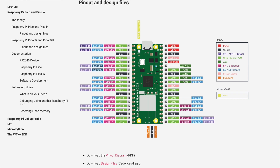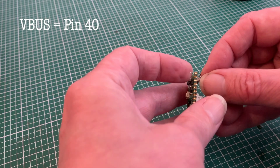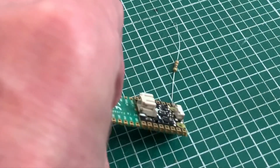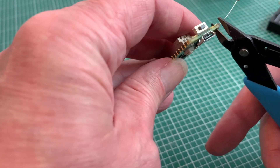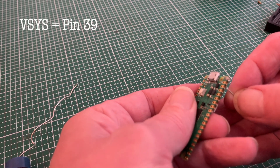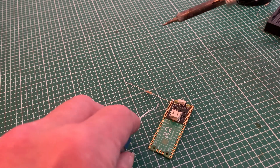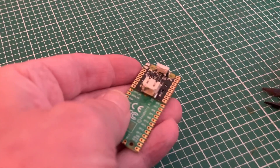First I want to double-check with the pinout diagram which ones are which. A good place to start is pin 40 in the top right-hand corner for VBUS. For each of my connections I'm going to use a little bit of resistor wire, pushed through the hole and soldered on each side of the sandwich. The resistor itself is completely incidental so that can be snipped off as close to the edge of the board as possible. Then the same thing for the next pin — pin 39 — which the schematic shows connected alongside VBUS, so I'm soldering my little bit of resistor wire on either side of the board and snipping off the spare.